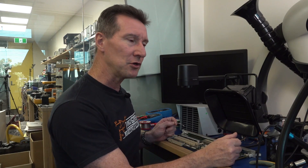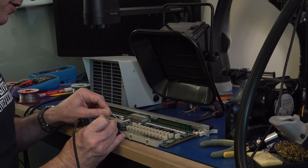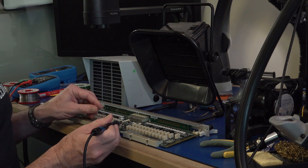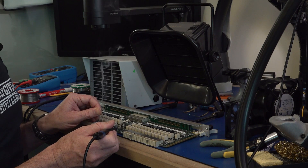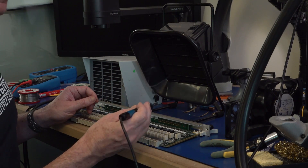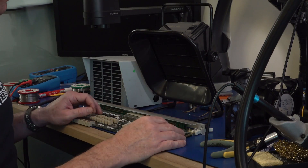This one's actually not too loud. Noise is one thing. If I start soldering, hopefully you can see that a good lot of the fumes are going in there and being captured. But some of them are coming right over the top because you've got a distance gap. If I go right to the edge of the board, the fumes are going straight up in the air, right in my face. You have to be reasonably close to these things to get most of the fumes sucked in.